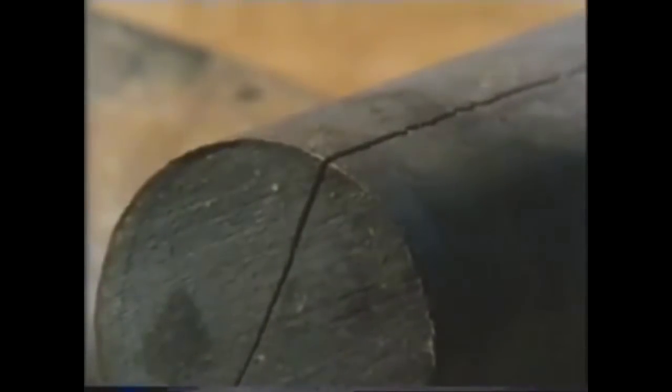As a quenching medium, water is cheap and plentiful. But because it cools the metal so rapidly, there is a danger of cracking or distorting the metal. That's why oil is frequently used. The cooling effect is not as rapid. As a result, the component will be slightly less hard, but the risk of distortion and cracking is greatly reduced.